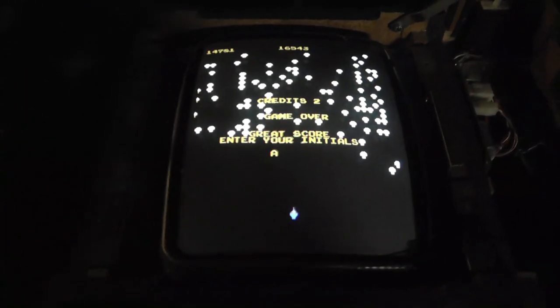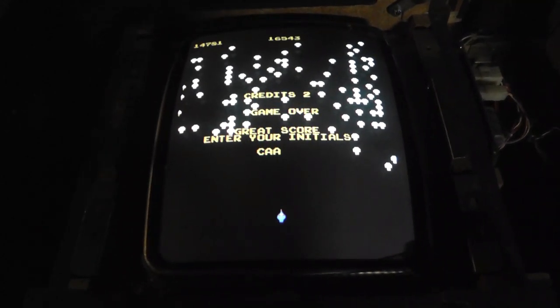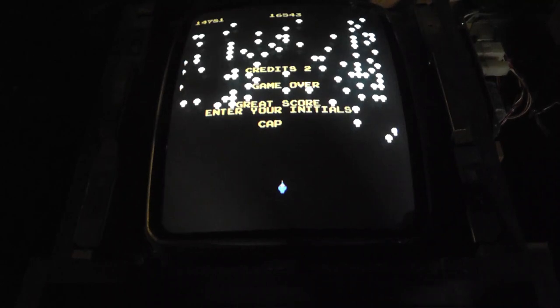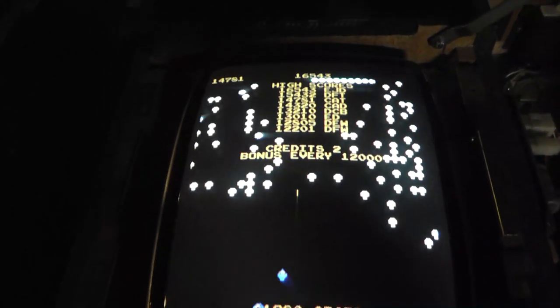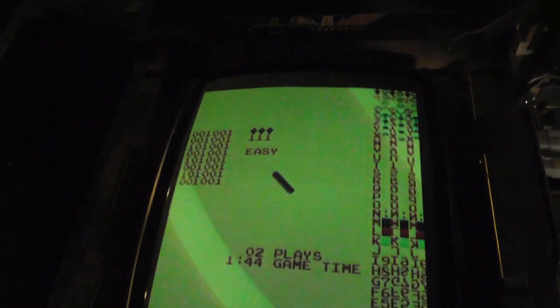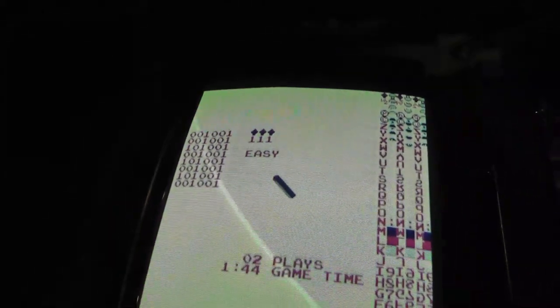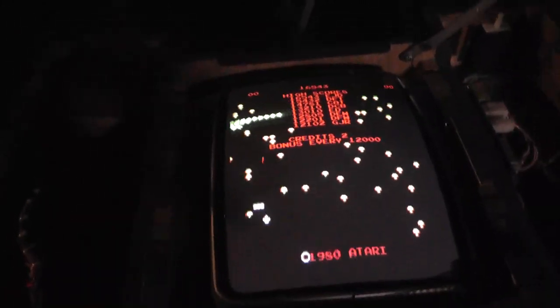All right, I played a game real quick, so let's put in our initials. I didn't get the high score. We're going to do cat, I guess. All right. And now let's, okay, that's number 3. Let's power off. We're going to put it into test mode. Our 4FF is gone. And our high score is there. All right, so the high score save is fixed.